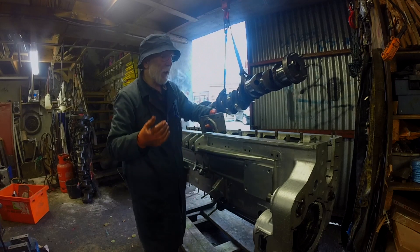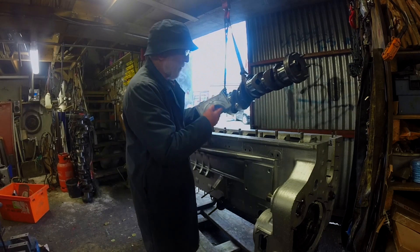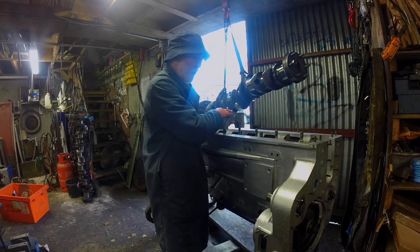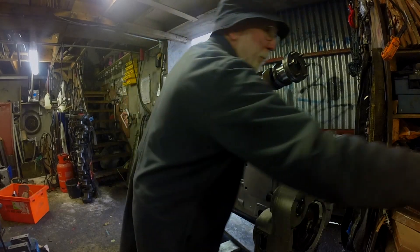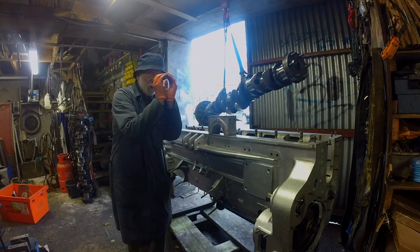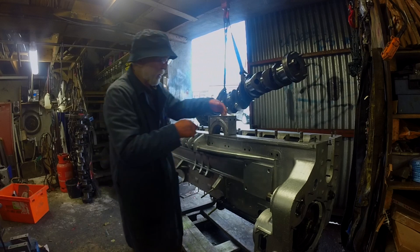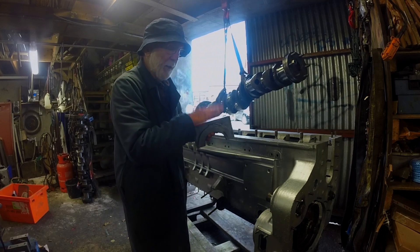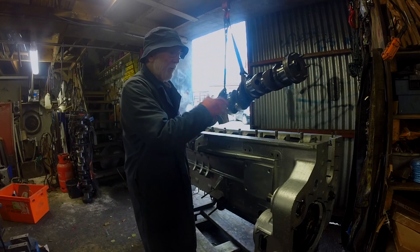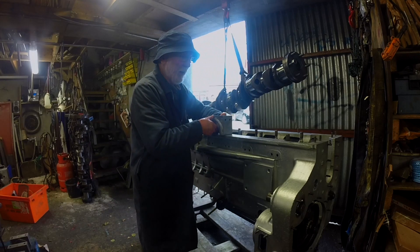If we wind the clock back to when this engine was actually manufactured, what Gardner did was — without the shells — they simply tightened down these bridging pieces, torqued them to their proper torque, and then line bored: they ran a great big boring machine all the way down through there so that it formed a perfectly circular tube, very accurately machined. That means these main caps, or bridging pieces, can only be used with this crankcase — they were machined for this crankcase in place. You can't take them off and use them in some other crankcase.